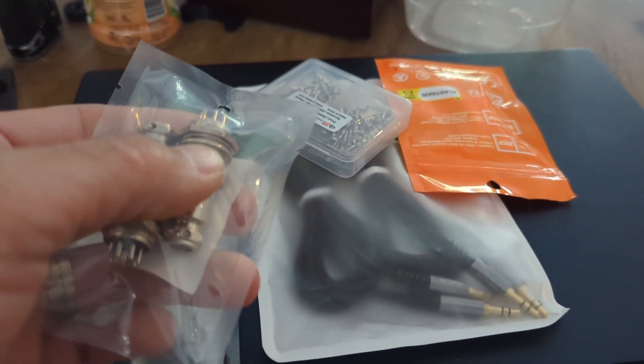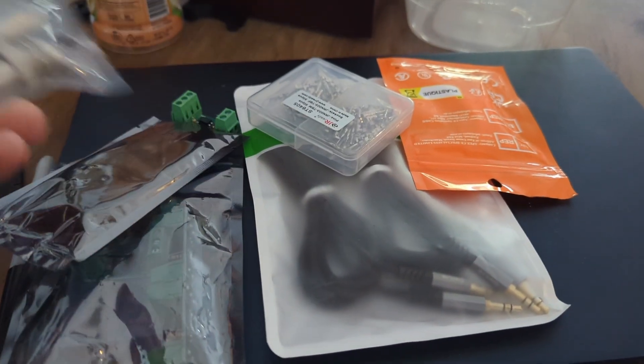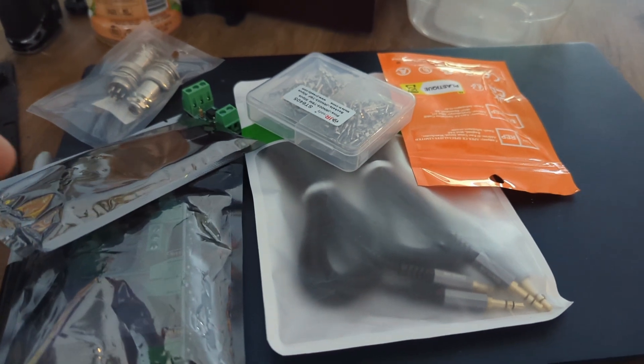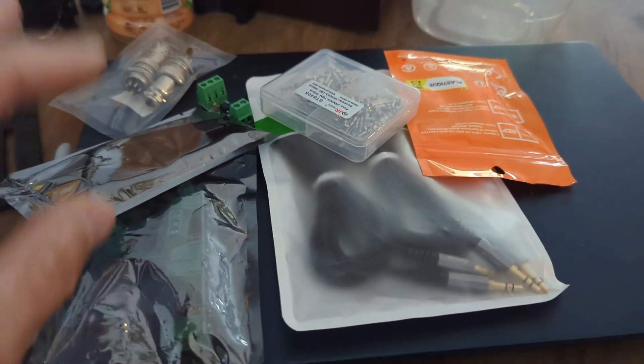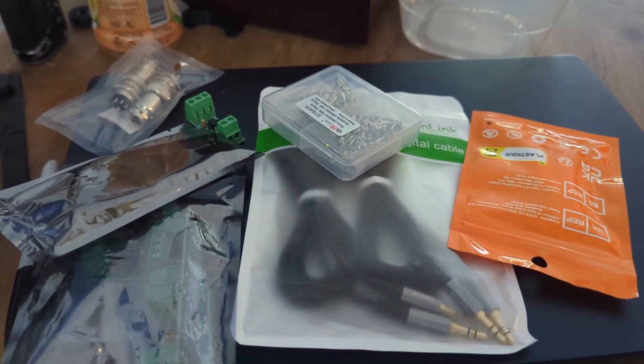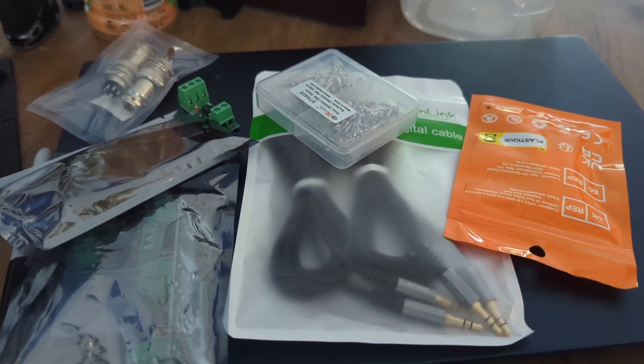I'm going to use an 8-pin microphone jack for audio in, and then audio out from the speaker out — there's also an audio out somewhere else in the connector, like line level. I'll figure it out. I'm going to try to at least get this thing to transmit and receive with software, because if not I can't use it for digital modes at all for a moon bounce attempt.